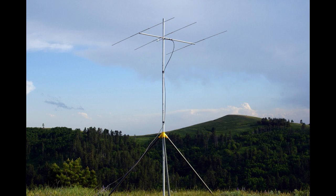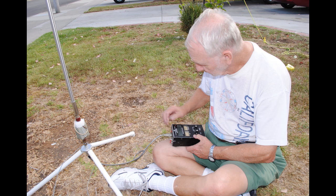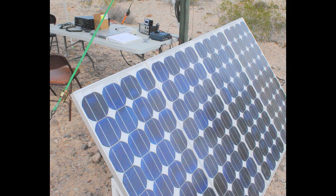Now there's a more modest station — it's in the clear, on six meters, standing tall. That's a nice field day station. If you feel brave and don't have a lot of wind, go ahead and put up one of those — they offer about 6 dB of directivity and gain. Bring along that SWR analyzer. Stay about two feet away from the antenna you're tuning. Solar panels — those are good to have.